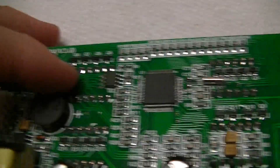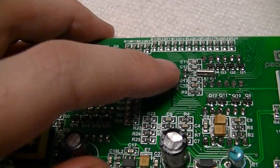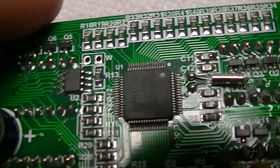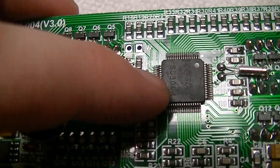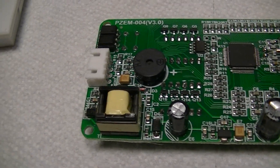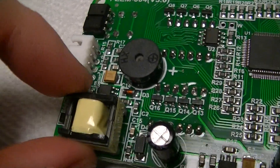On the back there's not a whole lot going on. Once you know what's happening, every bit of the energy monitoring is being done by this microcontroller. It's an SDIC-branded — never heard of them — SD2004 microcontroller, almost certainly some kind of energy meter type chip, given all the LEDs and their operating current.